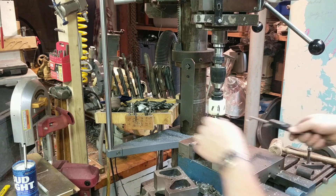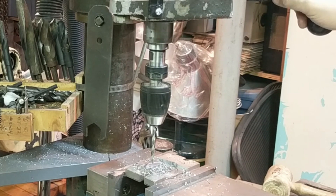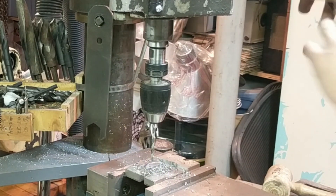It's fixtured up, so why not take advantage of that? These holes are offset — they're 1.360 total, so they're offset 0.680 from the center. I've got a tap drill for quarter-20, and I've offset it by 680 from the center.